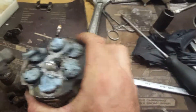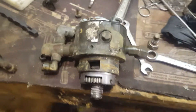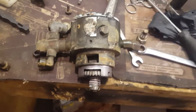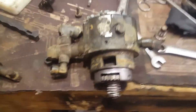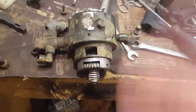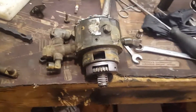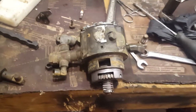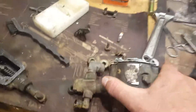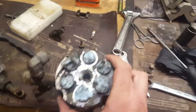When the plunger is actually free, you'll be able to push down on it and it will move up to where it is now, and when you let off it'll come back down to its resting position. You've just got to work with it, be patient, and use plenty of penetrating oil. I use Kroil — it seems to work pretty good for dissolving varnish left behind by diesel fuels. I'm sure there's plenty of others that'll work, like PB Blaster and whatnot. It's entirely up to you; I'm not here to debate penetrating oils. Kroil works for me — if you want to use something else, fine.